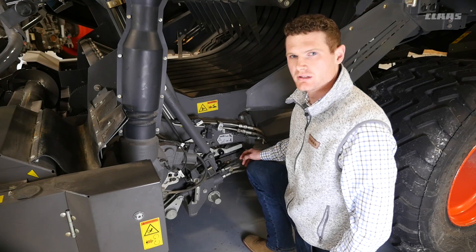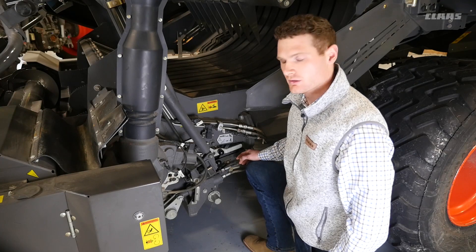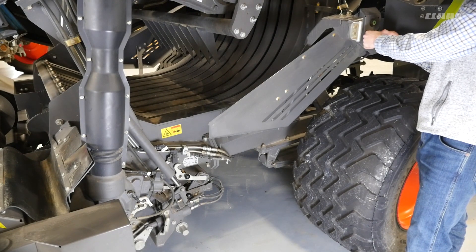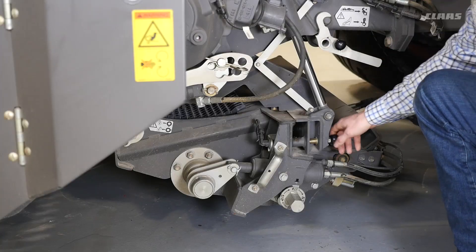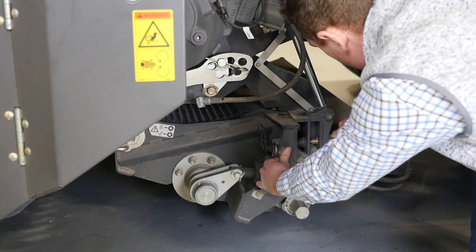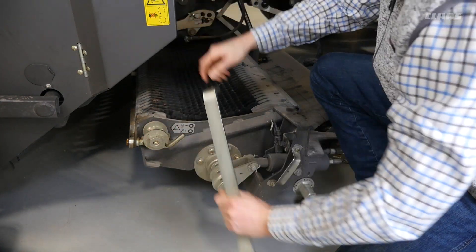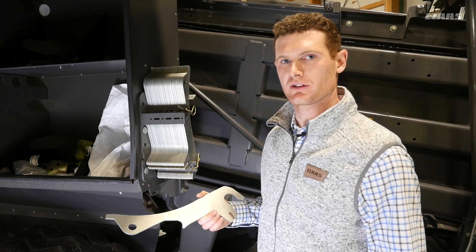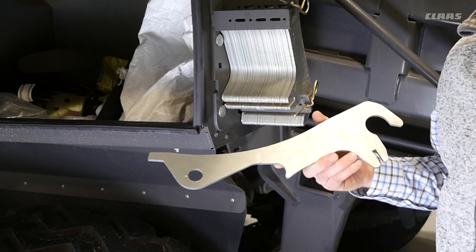The Quadrant 5300 is equipped with a hydraulic drop floor, which can be used to access the knives. To service the knives, we will first lock the drop floor into place, then drop the floor. To access all the knives for service, the floor can be moved to either side of the baler. To remove the knives, we must first unlock them. When baling without using the knives, it is important to install the dummy knives to ensure the knife drawer will not become full of debris. These dummy knives can be found on the rear of the twine box.